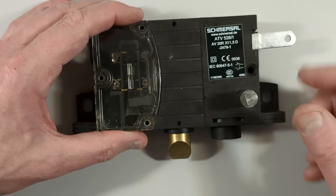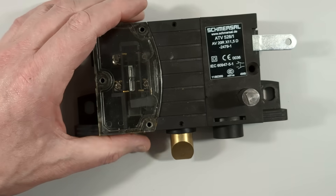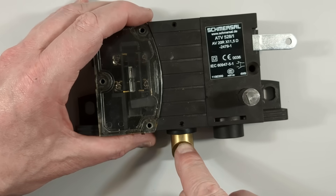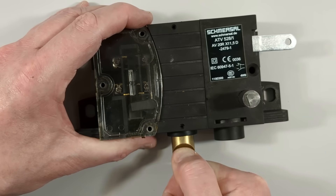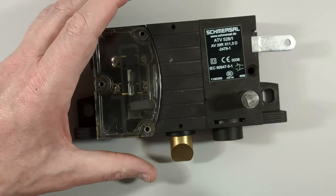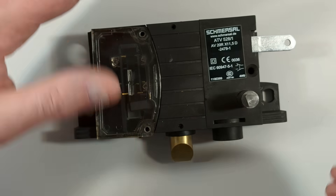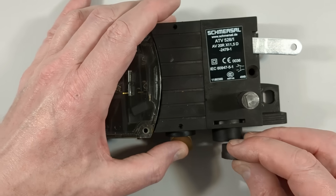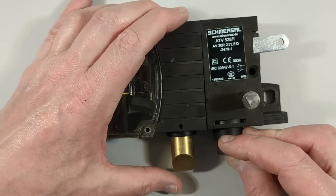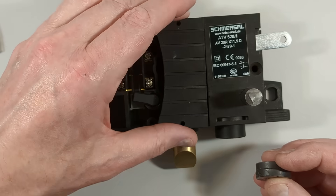When this arrived at floor level, the solenoid would pull this in and it doesn't drop down all the way. It drops down just enough that the door can push it as it closes. To make sure the door is actually there, it has a magnet on the door. This is a safety interlock system so that when the door does close and pushes that up, it drops down much further and also makes an extra electrical contact in here.